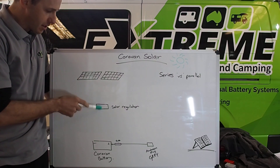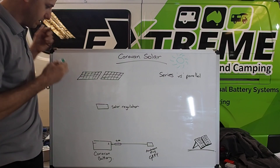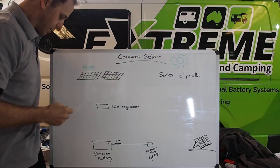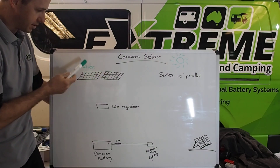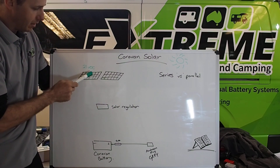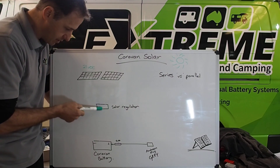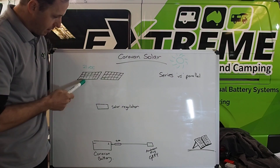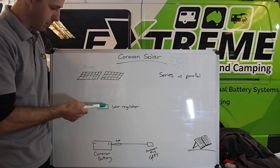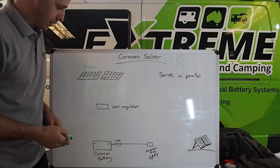You want to get that bulk drop as minimal as possible, so you want to get the regulator really close to the battery it's charging. The voltage coming into the regulator from the panels is a lot higher anyway — if these were in parallel, 12V panels are called 21 VOC (voltage open circuit). So if panels are tied in parallel, it's still 21 VOC, just with higher amperage going into the charge controller. The volt drop on the panel side isn't as critical as on the battery output side. That's why the regulator needs to be as close as possible to the battery, and then you can run the cable from your solar to your regulator with a correct gauge cable and you won't have any problems.